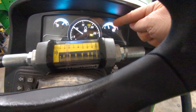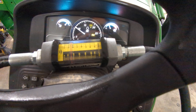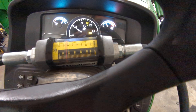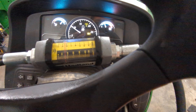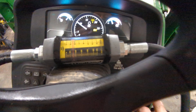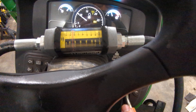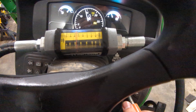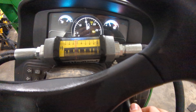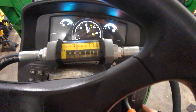You can see we're at operating temperature — I haven't measured it directly but the tractor's been running a bit and I've been using the loader, so I do expect it's at operating temperature. We're staying just above four gallons a minute at idle, which is 950 to 1000 RPMs. We'll jump up in roughly 500 RPM increments. At 1500 RPMs we're seeing almost six and a half — a little more than six and a quarter but not quite six and a half.